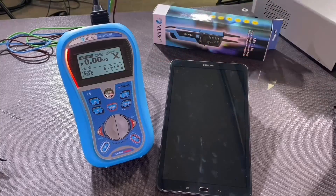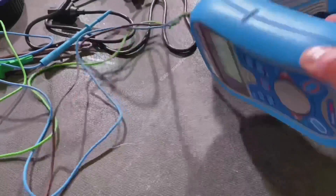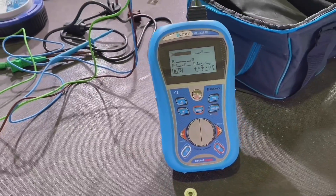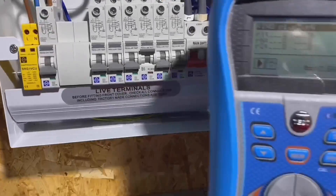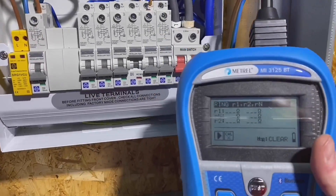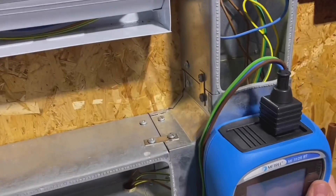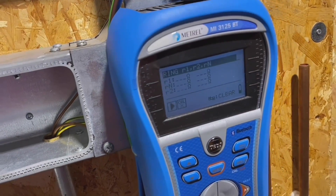There's a little stand on the back — a nice flat surface that gives you an angle for a clearer look at the display. But there's something on the back I really like: if you're at the mains end carrying out a ring final circuit test and you'd like both hands free, that circular section is a magnet. You just stick it to the front of the trunk or panel, allowing you to carry out the test with both hands free.